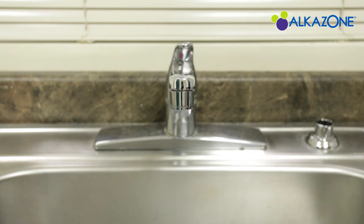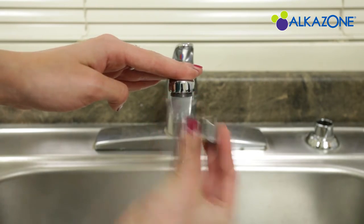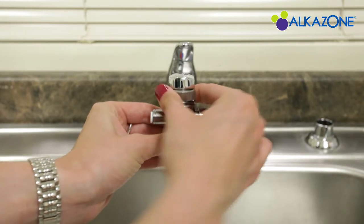Let's now connect the thin hose to your cold water source. You have two choices for this. 1. Connect it to the diverter attached to your faucet. 2. Connect it to the running water line connection adapter located under the sink. To do it with your faucet, install the diverter to your faucet. You may use some coupler if necessary.